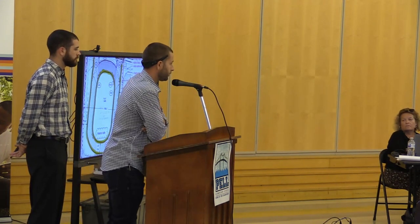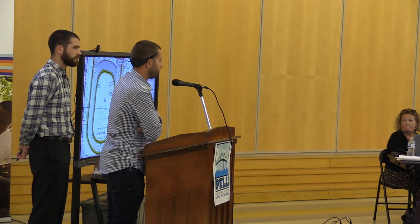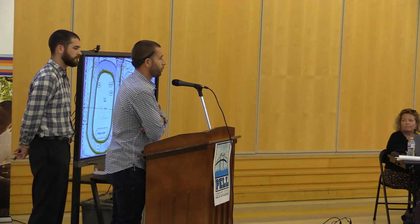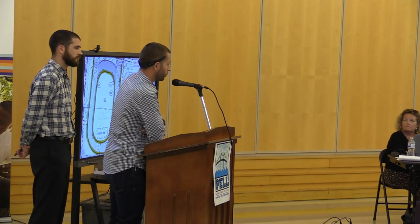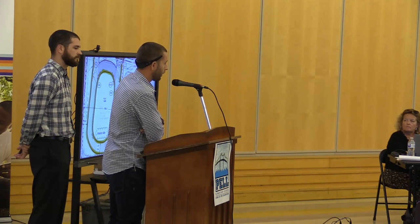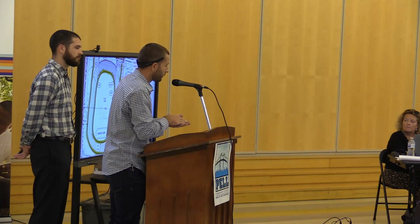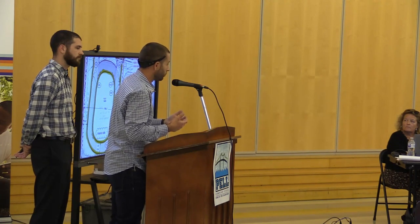Berm detail is just, I mean, granite will be stronger than precast. It'll have a long-term view compared to the bituminous berm. But the bituminous berm, as spec'd, is a RIDOT detail, so it's integral to the pavement. It's not added after the fact, so it is a RIDOT standard. It is a Newport DPU standard.